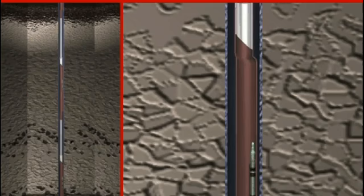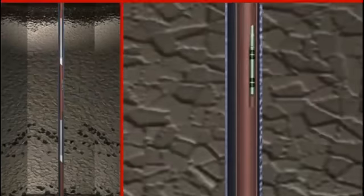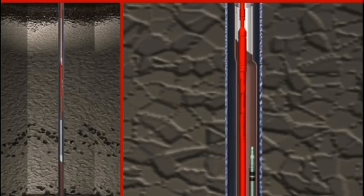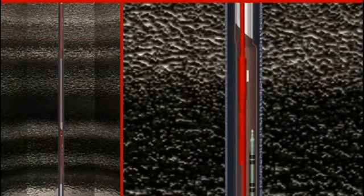After a successful hydro test, the dummy valves are retrieved by a wire line, starting with the bottom dummy valve and continuing in sequence, retrieving the top one last. As the kickover tool approaches the depth of the bottom mandrel, the operator will slow the speed and proceed through the mandrel. The operator will then start uphole slowly, and the KOT kickover tool will make contact with the orienting sleeve located in the top portion of the mandrel. This directs the kickover tool out over the dummy valve.